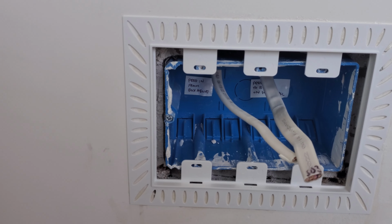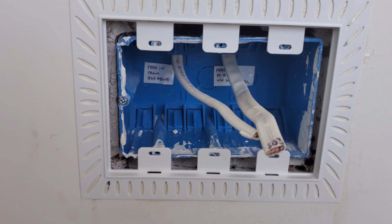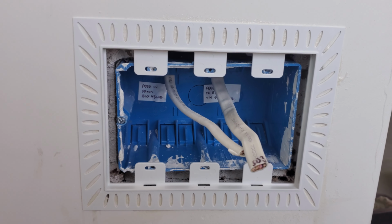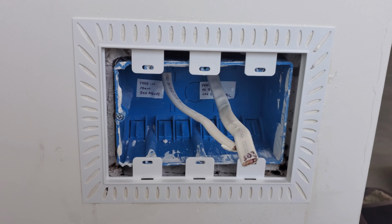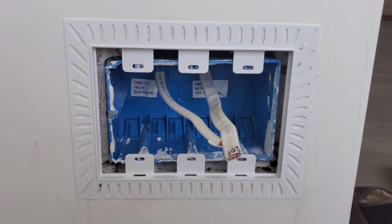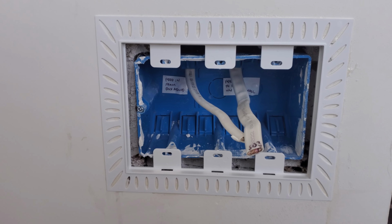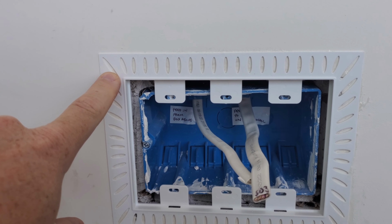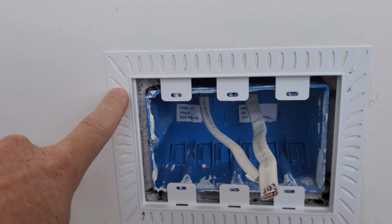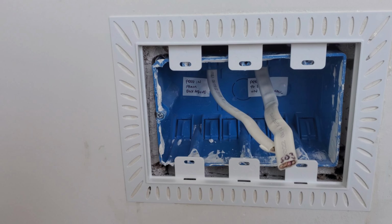So the way it works is you have to cut the drywall back a little wider than the box. So it's about a 1/2 inch wider. You got to go around and do it. We did it ourselves. Probably could have had the drywall crew do it, but since we hadn't done it before, it was hard to tell them exactly what to do. So essentially the process is you get the extra drywall cut out, and then you can install this. We used spray-on adhesive, and it seems to hold it pretty well, just kind of essentially gluing it to the drywall.